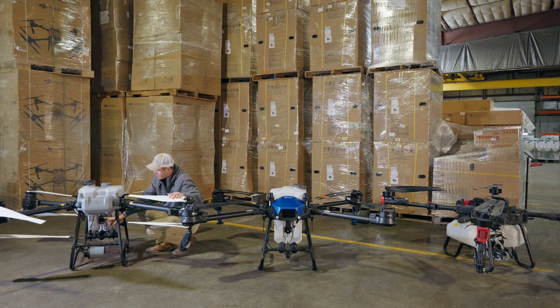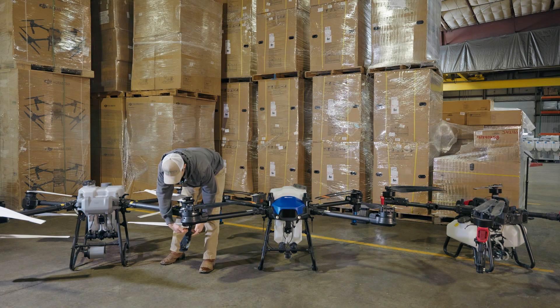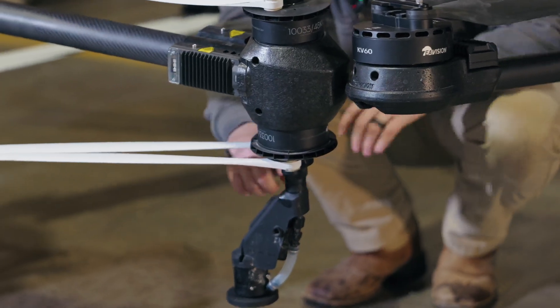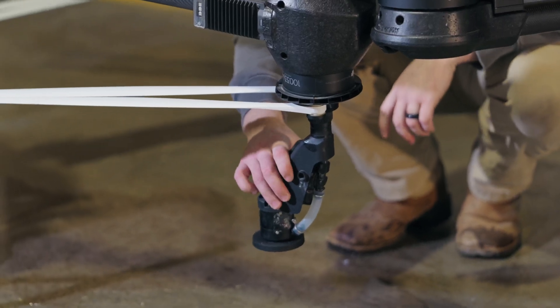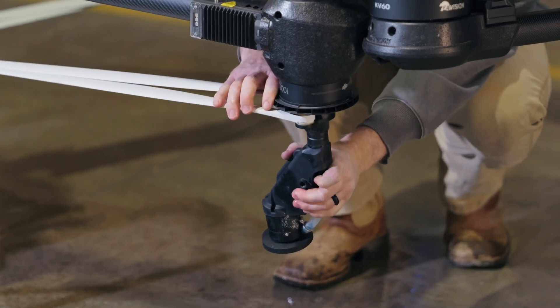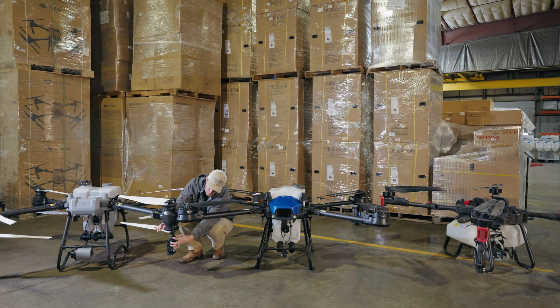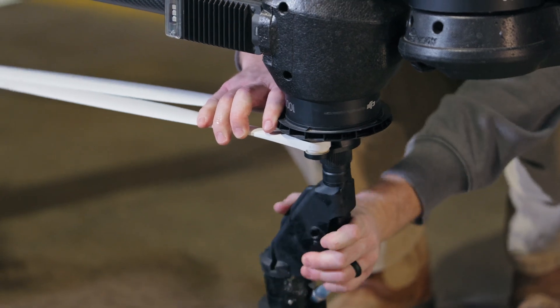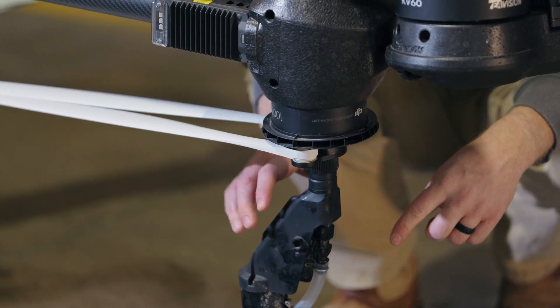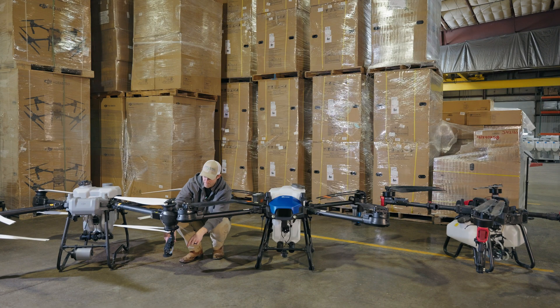From the DJI pump, it runs up through a dual-channel flow meter, through the hoses and arms, through the center of the motor, and out through the atomizer — because the motor is on the bottom, liquid has to go through the center of the motor. However, the DJI atomizer has durability issues: the rubber boot separates from the lower housing over time, which is thin, cheap plastic. The nut also attaches directly to the motor shaft itself, so if it wears out, you're replacing your motor — not just the rotary atomizer. It does have a single disc, a bit more robust than the XAG, but still a very lightweight single disc.